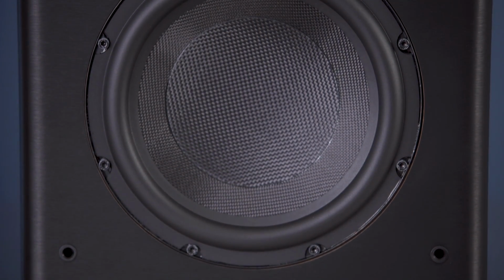It's a very gentle kind of curve, and what it does is it just gently, progressively takes out all of that crud, that infra-bass material that can actually damage drivers and amplifiers, well below the resonance of the driver. It just slowly takes out all of that stuff, which means we can push our limiters and our amplifiers harder, knowing that it's not going to see something down at 12 hertz and try and reproduce that, waste all of its energy, and destroy the driver.